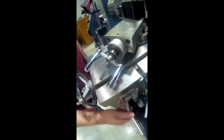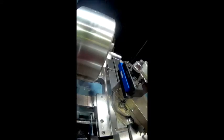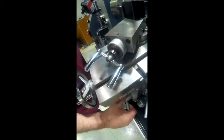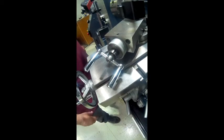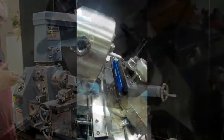We'll watch the threading dial down here. When it comes around to one, we're going to engage it. There we go — here's our second pass, comes in right on top of the first one. Disengage. Now you see we've made two passes right on top of each other.